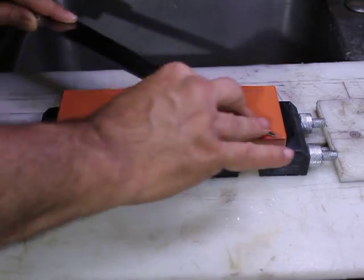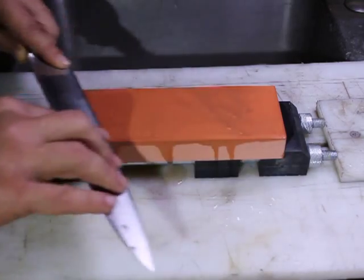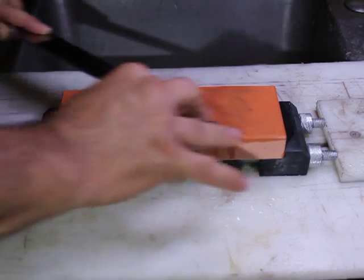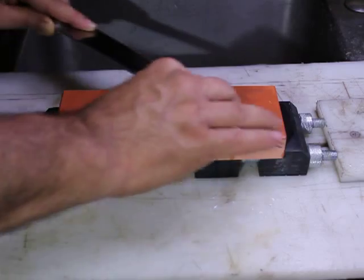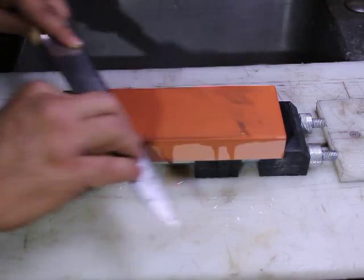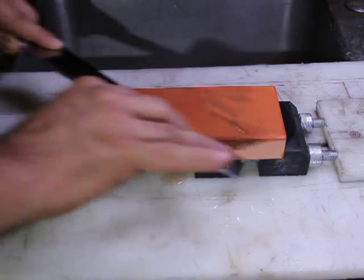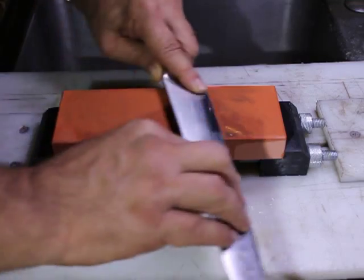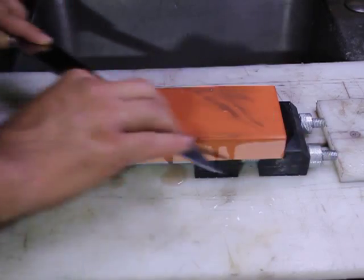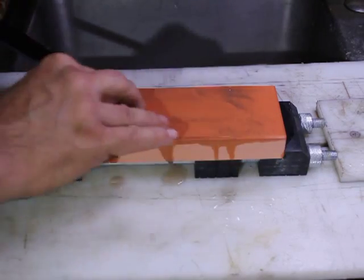This seems to have the hardness pretty much in the range of a 5,000 grit Shapton, a bit more porosity, a lot more feedback than the 5000 Shapton. It's considerably harder than, let's say, a 5000 Chocera stone. I'm pressing fairly firmly. There is no danger whatsoever of cutting into the stone, so edge leading and trailing strokes, not a problem at all with the stone. We'll see if this has similar characteristics when we deal with the carbon steels next.